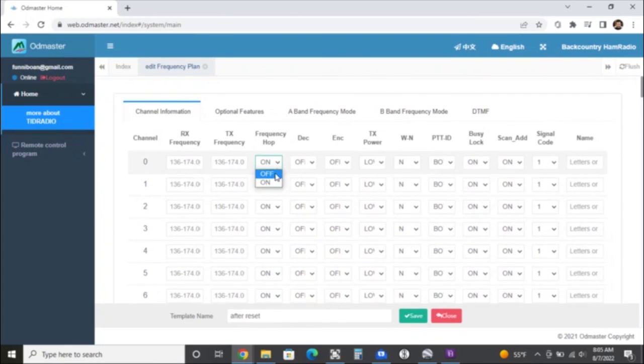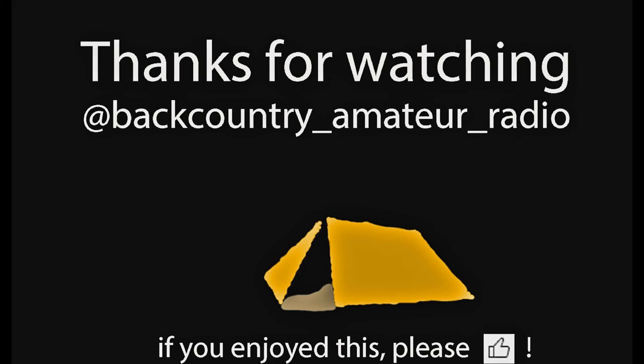This is obviously happening with the Odmaster app and not anywhere on the radio or in the other programming software. The app is turning on frequency hopping and PTT ID and changing my FM settings from wide to narrow. Now, I did this all so you wouldn't think I'm crazy or that I'm messing up my settings, but I would like some feedback. If you think I'm messing up a setting somewhere, I just feel like I've covered all my bases here on what I can do.